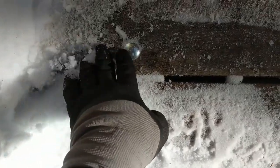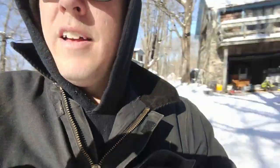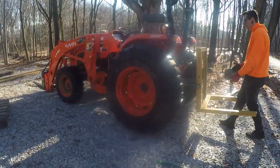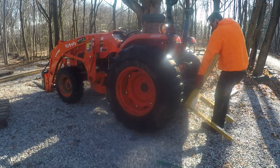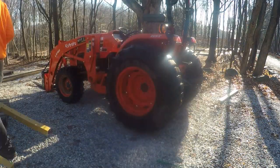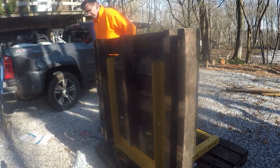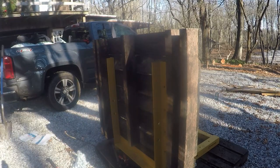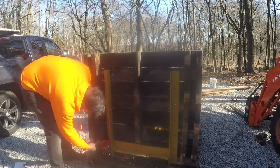The carryall has specific holes, and so I just drilled them where I needed them — those are half-inch by three-inch carriage bolts. So step one was to build the floor and the back. I had the carryall off of the tractor, tipped it on its back since it looks like an L, then clamped the pallet to the carryall, drilled the holes, and secured them that way. Then I basically just did the opposite for the back.